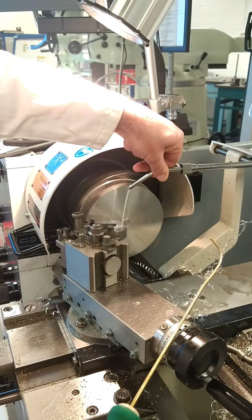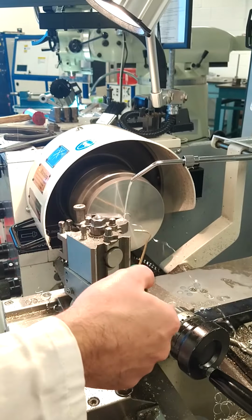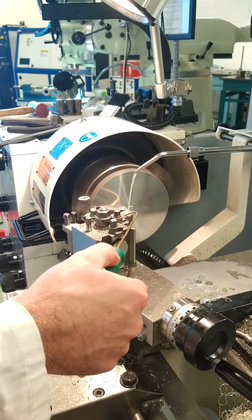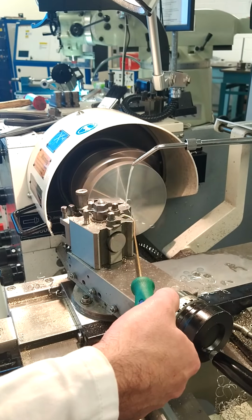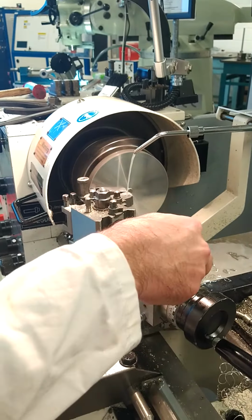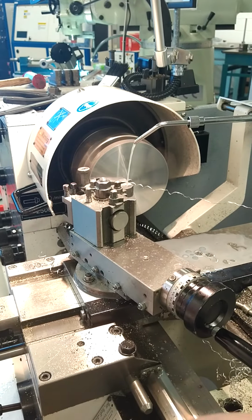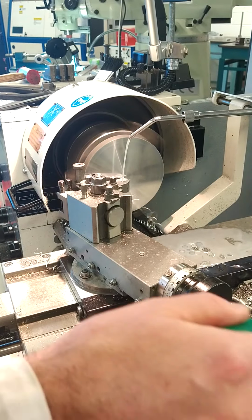So as we're machining there now, we're applying the coolant on there, keeping it onto the tool and not onto the work, and we're getting an excellent finish on our part. And the material is called this continuous chip. That's a very malleable material, the aluminium. It's very easy to machine. That's called a continuous chip that's firing away.